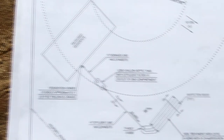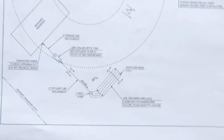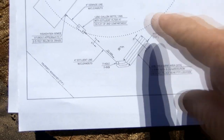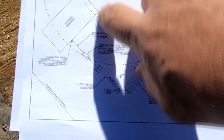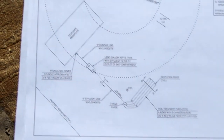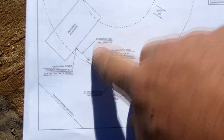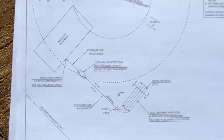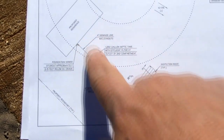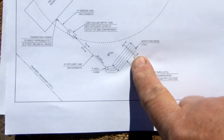Whenever you dig a septic tank, you have to make sure it's not near any wells or anything like that — you've got to protect your groundwater. The proposed residency's got this oriented wrong; it should be turned this way a little bit. There's the well, and our septic tank will be at least 50 feet from the well. This is a 50-foot radius, this is a 100-foot radius, and our leach field needs to be at least 100 feet from the well, and he's got it showing that.